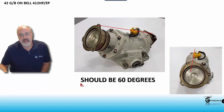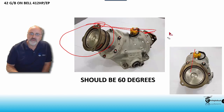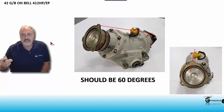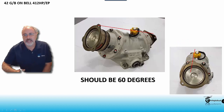This one is not a big deal, but I want to mention it — it's about orientation. You're going to have the flex coupling or the 42 gearbox and the forward adapter. By the books, you're supposed to install this at 60 degrees, which is the center line of this part. In this particular case, it's not aligned. Even in Belgium there was some conflict between engineering publications, and even in Canada assembly, we saw helicopters coming from Montreal to Bell to the customer where these were aligned on one and not aligned on the next. My advice: follow the books. The book will tell you it's supposed to be 60 degrees from one side to the other. Watch out for this and make sure the orientation is correct.